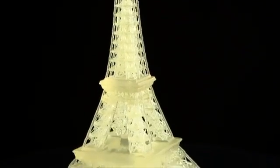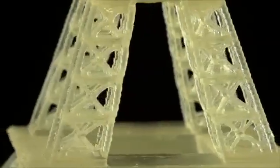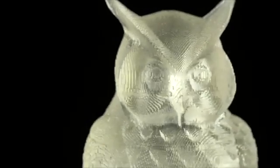The resolution achievable within its paper size build area is awesome. Solidator creates 3D points, so called voxels, with a size of 0.27 millimeters by 0.27 millimeters at a 100 micron layer height.